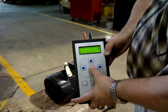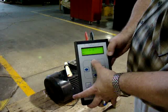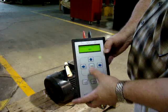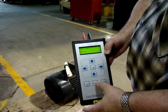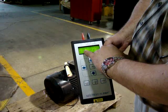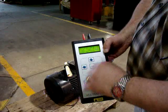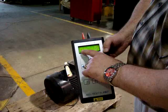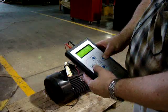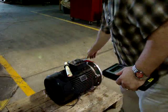Press OK. Before you do anything you want to save — we'll call this A, B, C, Phase — and save the name. We've got high, low, high — 69 straight across. Balanced, and everything is balanced, so we know the winding is good. Now let's compare that to the Baker.